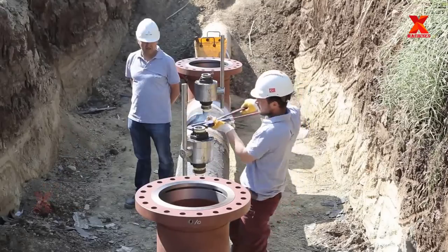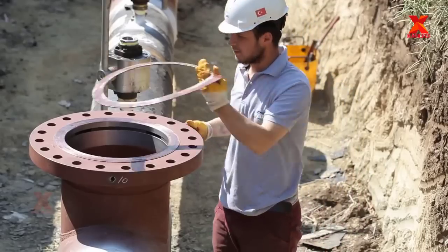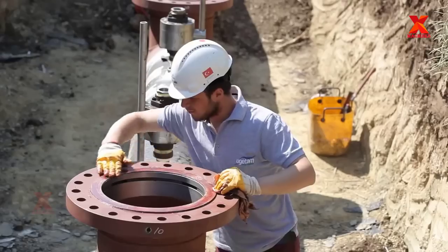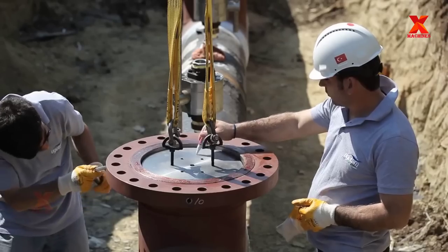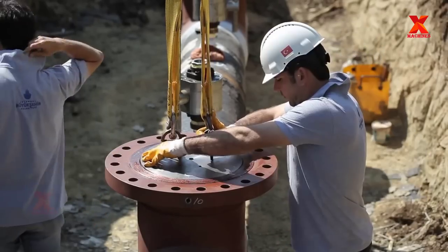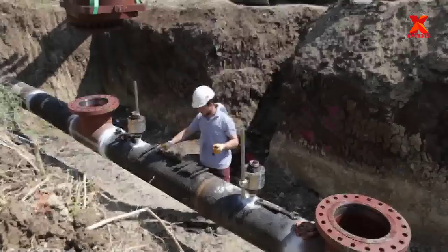Connection to the existing pipe is made with a fitting, which can be a simple welded nipple for small connections to a larger pipeline, or a full encirclement split sleeve T for extra support when the branch is the same size as the parent pipeline. The T wraps completely around the pipeline and, when welded, provides mechanical reinforcement of the branch and carrier pipe.